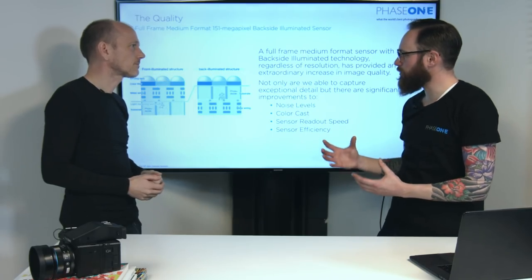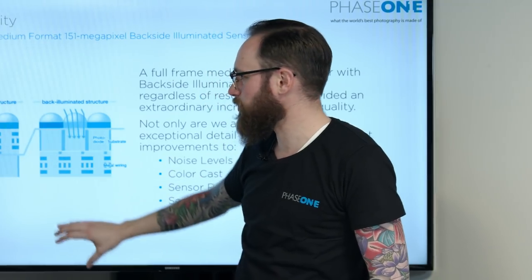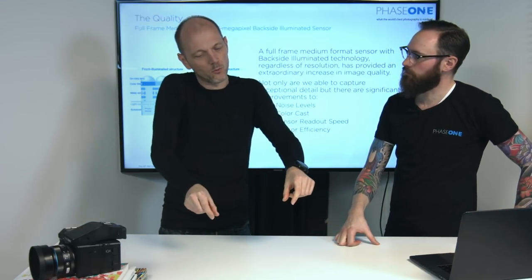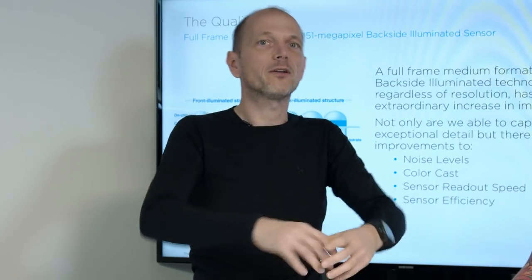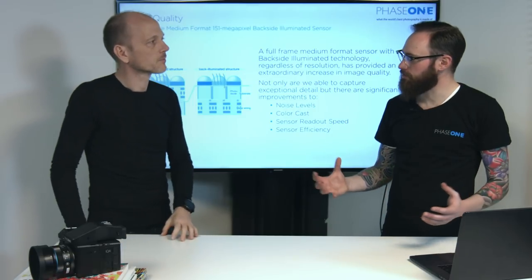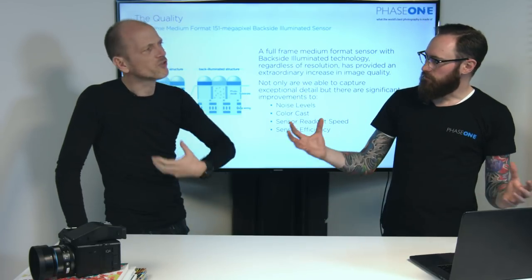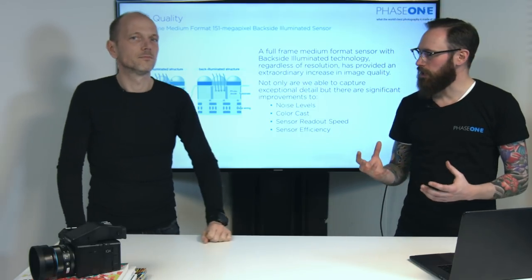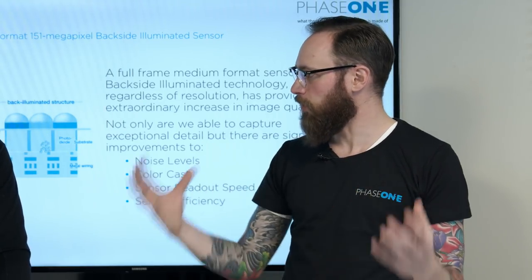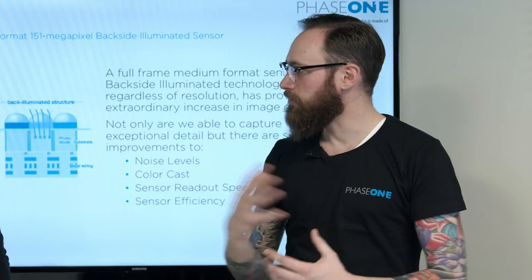Because it's backside illuminated, because we don't have the limitation of how much electronics we can cram into a finite space, we really have as much space as we want to add electronics to the sensor. With front side illuminated there's always a compromise between how much surface area is used for electronics and how much light can pass through. Now that we've put it on the back side, we don't have to make that compromise anymore — we can put more electronics into the sensor, which means faster readout speed, new ways to communicate with the sensor, and new types of features built into the pixels themselves. Altogether, backside illuminated is really the future step of sensor technology, and having it in full-frame medium format with 150 megapixels means a lot more information, better information, and more speed in reading out that pixel.